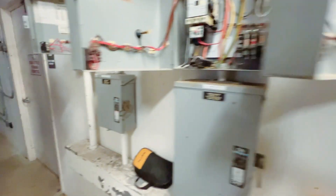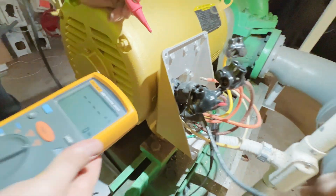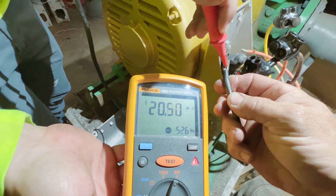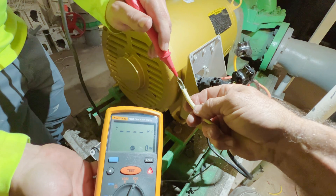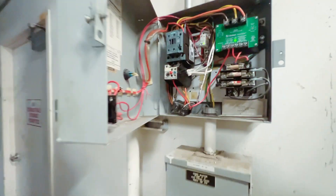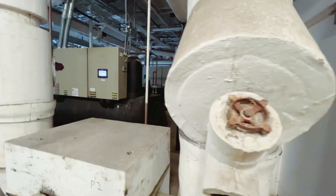These alarms happened early this morning at 3:20 AM. Pump number four is isolated — it's bad, power's disconnected to that one. So we're going to be able to start up pumps two and three, which should give us chiller one operation again. Chiller two will remain down.